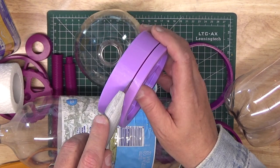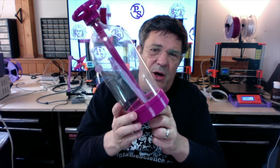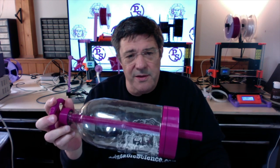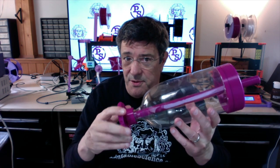That wasn't the end of my problems, because the force required to cut the bottle was significant enough to knock or nudge the platen out of square with the sides of the bottle, leading to a very unsatisfactory non-square cut. So the next step was to design and print a lead screw that you could put in with a handle at the top of the bottle, with the additional advantage of providing accurate positioning of the cutting groove exactly where you want it.